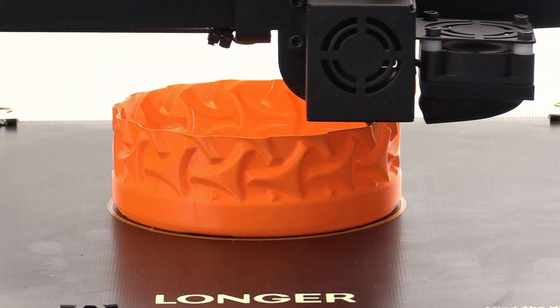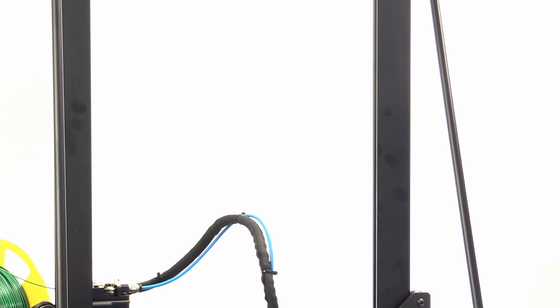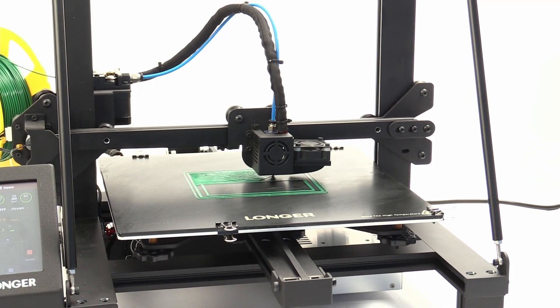This type of printer always has a huge downside and that is the flexibility of the z-axis, which you don't want. The bigger the printer frame is, the more problems you get when printing objects that are actually big. Take a look at the big Creality machines or the beloved Artillery printers — they both can print the same sized objects, yet when the print gets bigger than around 200mm in z-height, they always start to show artifacts because the gantry starts to wobble in the z-flexibility.